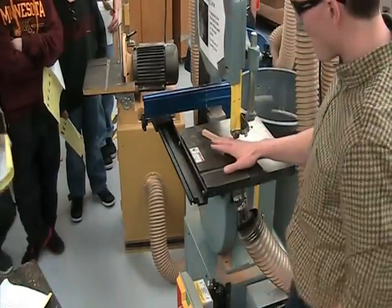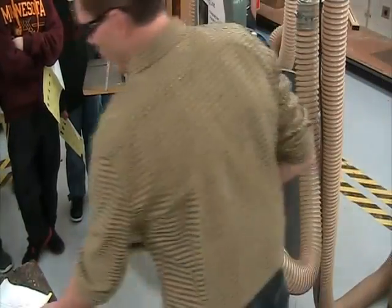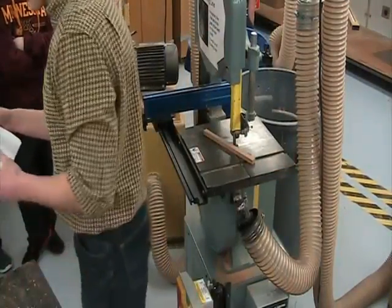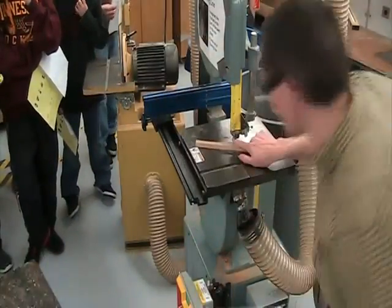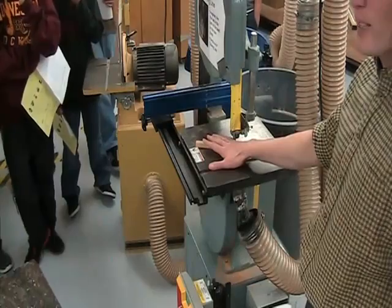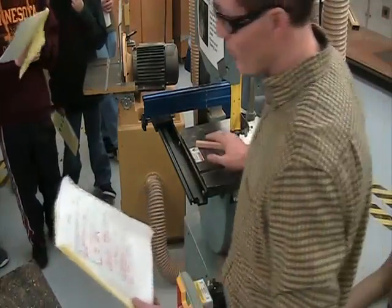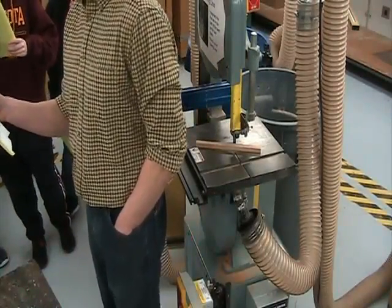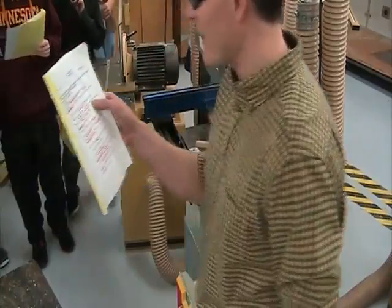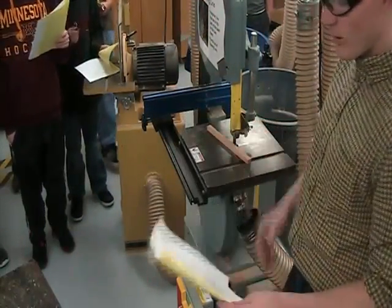If you leave the guard up, your hand can fit there and you'll get hurt if you mess up. For questions three and four, talking about the setting — three or more teeth showing means your hand can fit in there, making it unsafe. It should be like one tooth showing if the answer is to read safely. Number four, setting the guard to a quarter inch — that's really the same question. Read it closely; these are similar to what you'll see on the quiz.